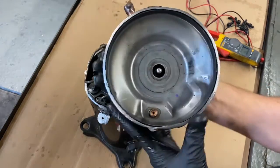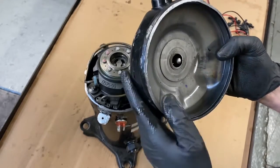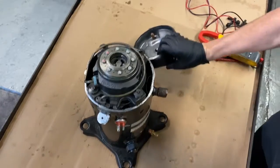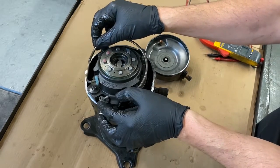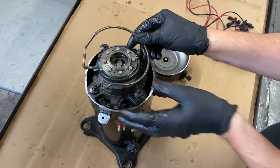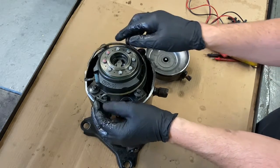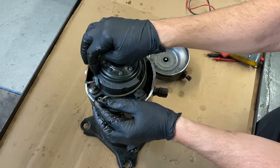When you take the top off, look and see if there's a lot of heat. Here's where the immersion bulb is for the injection. This is the temperature probe monitoring the discharge temperature. This is the injection tube — they took this off — where we're actually injecting refrigerant into the compressor to cool it down. Liquid refrigerant comes into this injection port. There is a DTC injection valve on here, and you want at least 5 degrees of subcooling coming into this valve. The refrigerant then flashes inside, cooling the compressor off.